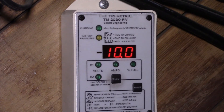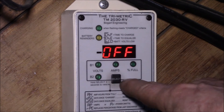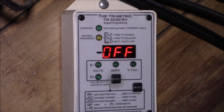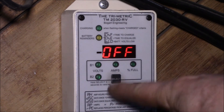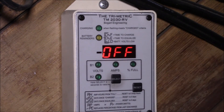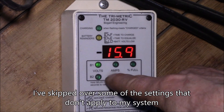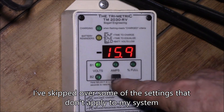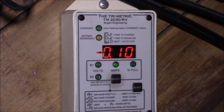There's also an auto entry feature where you can store multiple profiles. For example, if you have a 12-volt battery bank, a 16-volt bank, or a 24-volt bank, you can store all the parameters in several different profiles and switch back and forth. To exit parameter mode, just hit select until you reach parameter 22, and now we're back at the main volts display.